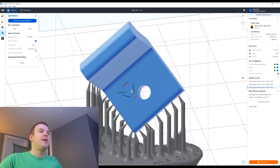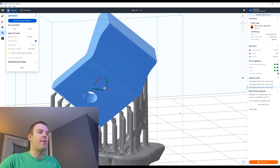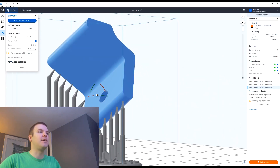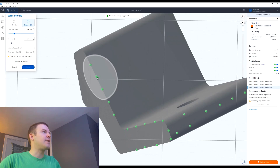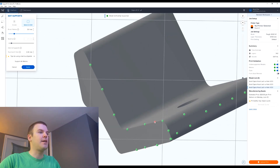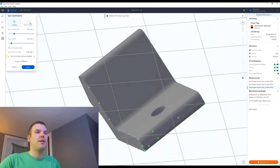This is a really small part and I'm using extremely small touch points. I usually start with this lighter version and modify from there. This part I could honestly go lighter with supports because I have no red showing. For a lot of my parts I'll try to go down into the red range — let's remove every other one here and see. Because this part is so small I'm likely not going to get any red, so I'll try to force it to show you.